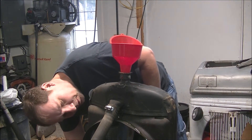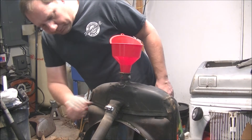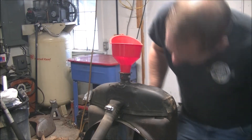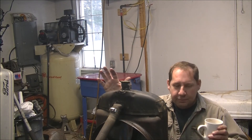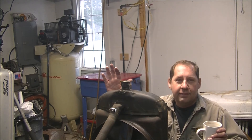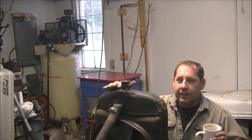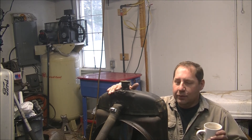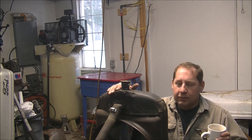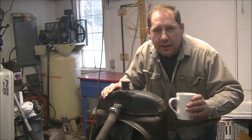Why is it leaking there? There's nothing more disappointing than being 15 minutes from starting the tractor and having a setback. I think a tree or something landed on this tractor — the hood was all caved in. This radiator has been repaired in the past. I don't know if it's worth repairing again. I know it's a good copper core radiator, but I think it's just going to vibrate and leak forever. Might attempt it, or might just order a new radiator and be done with it. Let's regroup and try her again.